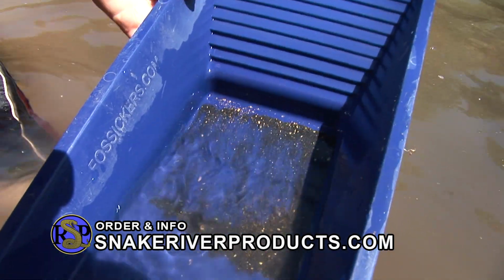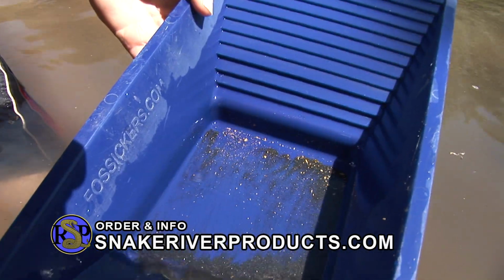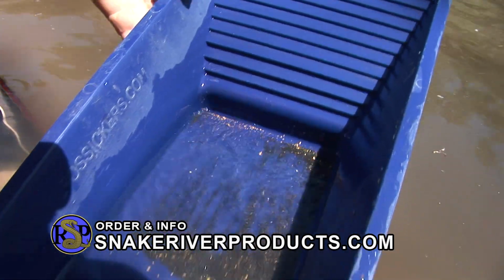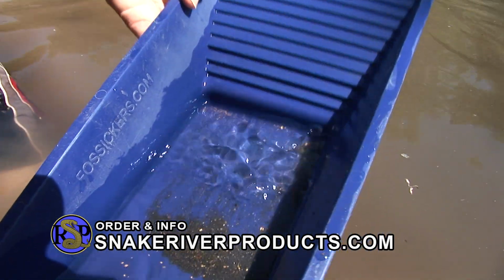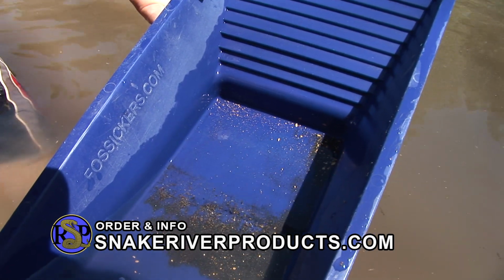So I see a lot of small stuff and larger flakes too. I don't see any nuggets, but still, that's a good sign. If it can keep stuff that small, it certainly can keep the bigger stuff too. Oh, absolutely. The sluice will go down to 200 mesh gold. So 200 minus is where it stops producing at near perfect results. So it will definitely get gold of all types.